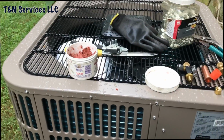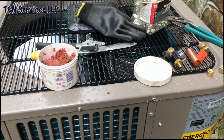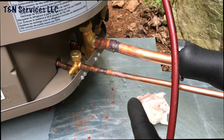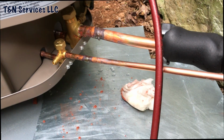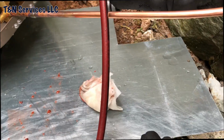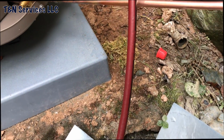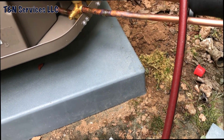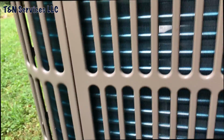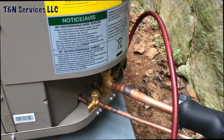As you can tell from the water drops on the unit, it rained a little bit. So I had to kind of stop, but I got it done. I'm just going to braze the outside, and then everything on the inside will get zoom locked. Not really a need for it, but just in case I did drip any silfos, I use that metal to protect the pad. But it's done, and I used heat dam up there for the valve, and then braze with nitrogen, of course.